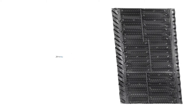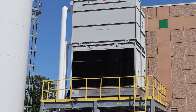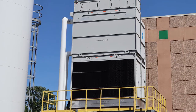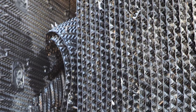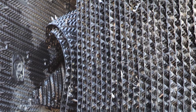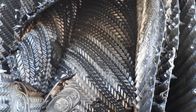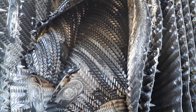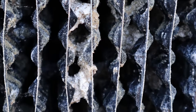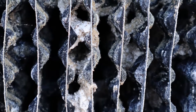In this video, we'll show you the process for repacking a crossfill cooling tower with Brentwood's XF75 Pro bottom supported block fill. This tower supports Brentwood's injection molding machines and had a sudden large decrease in performance. Looking inside the tower, you can see a portion of the factory hanging sheets have torn from the hangers, causing air bypass that reduces performance, a drift increase because the integrated drift eliminators aren't intact, and water hitting the louvers, causing scaling deposits.